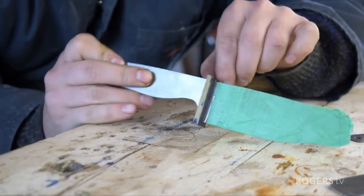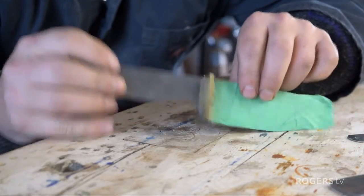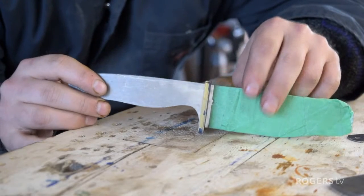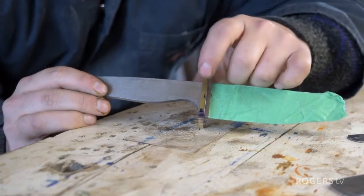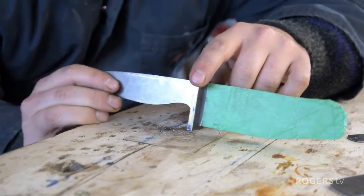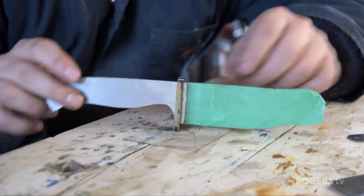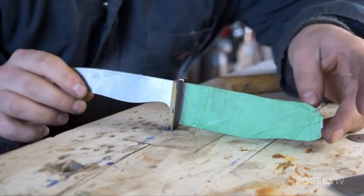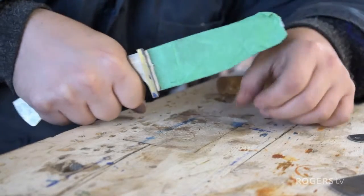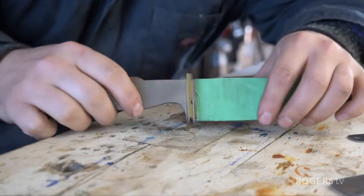And notice that this piece of brass now can't rotate forward. The only thing it can do is pull back off of there. So how we'll fix that, and this is a very tedious part, you need to get things accurate, we're going to put a pin straight through, all the way through the other side, pin on both ends. That's going to be nice, but you're getting an idea now of the size and scale of this knife. It's just lovely.